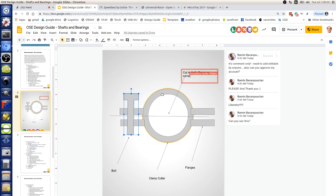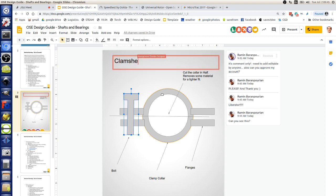There are still axial forces on the bearings to address. The three-inch bearings we're using can handle it — they're rated for several thousand pounds of axial force, I think around 5,000 per bearing. These are big bearings with some big balls in them. So to summarize: the ball bearing is the secret of industrial civilization. How do you make a ball bearing? If you have a CNC multi-machine with grinder elements you can do it. You make little rough ball shapes, then a rotating grinder disc — the balls fall in there and all their sides get ground exactly to the space between the grinding disc and a flat surface.